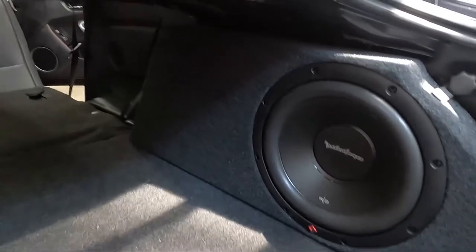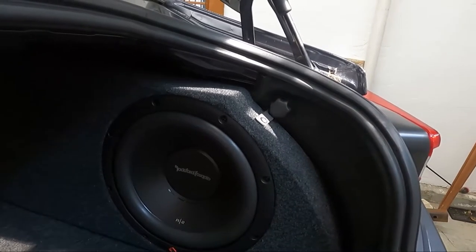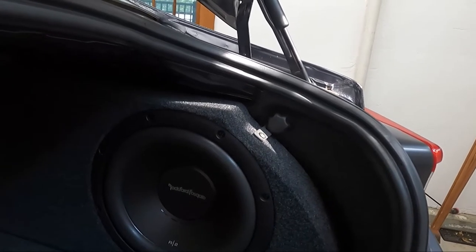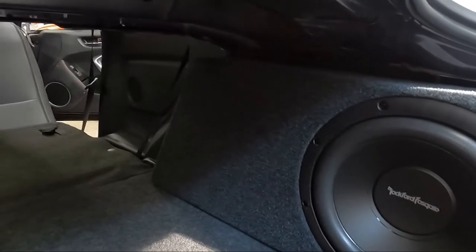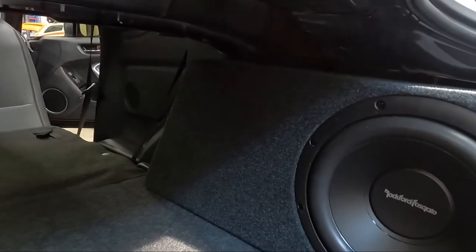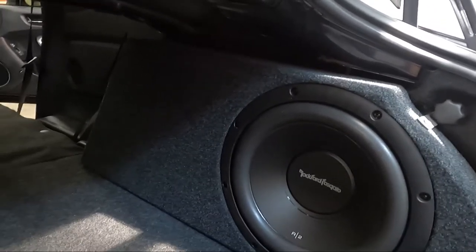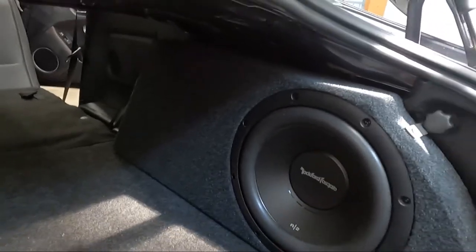Here's the finished product. Here's another bracket — I just bent that into an L-shape — and we've got a knob so we can do an easy removal without tools. I want to do that at the other end too, so I'll probably need a t-nut or threaded insert going into the box, and then I can put a knob on that. Two knobs plus the quick-connect on the wiring — I don't think we'll remove it a lot, but it's nice to have the ability to do it without tools.